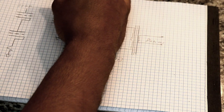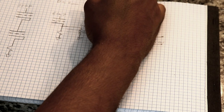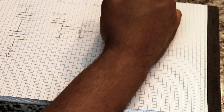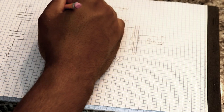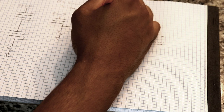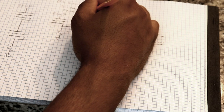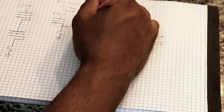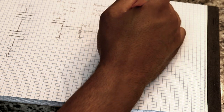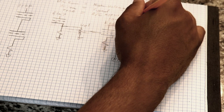The DC component would be your voltages — high and low voltages. Your AC component would be your signal. And your tone would be all the RC networks — resistor and capacitor networks that create low-pass or high-pass filters. Those are the three things we're trying to balance here.